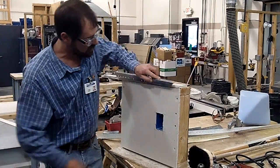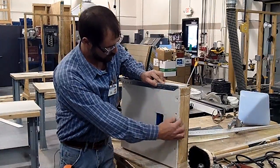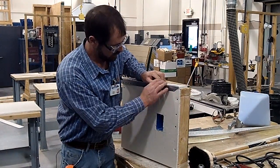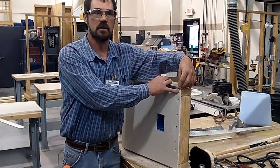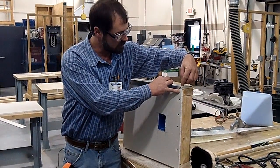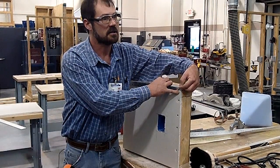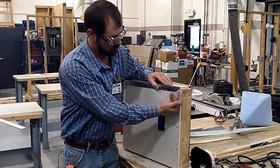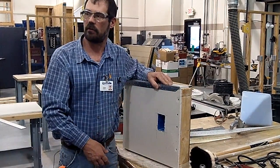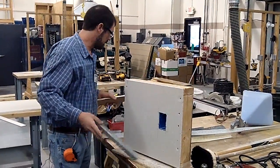You're going to have a lot of pieces coming together here. You'll have a piece coming up here and also a piece coming across here, so you've got three of them coming together right in this corner. You want every one of these to be on 45s so that all that's coming together is just this point here. If you let that all build up with all this metal and keep running it out square, you won't ever get them to fit good. We'll go over that more in depth later.